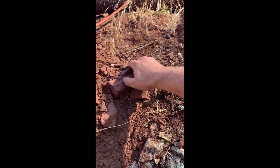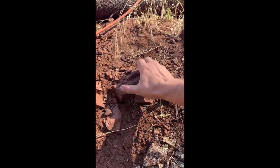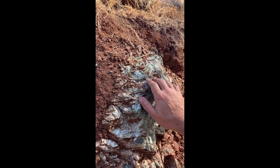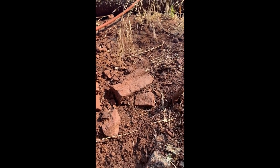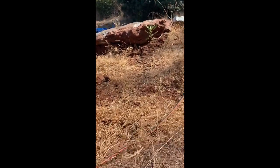And these are the pieces where having a jackhammer helps out a lot. The problem is when you dig a hole, you don't know if you're hitting this or if you're hitting this, because if I'm 20 inches down, I can't see down there. So what I typically do is use a post hole digger and a wrecking bar for a few minutes. If I start hitting resistance, I stop and go get the jackhammer, and then it can blast through it in a minute.